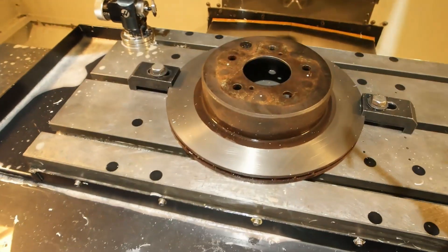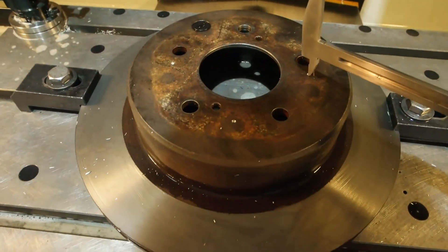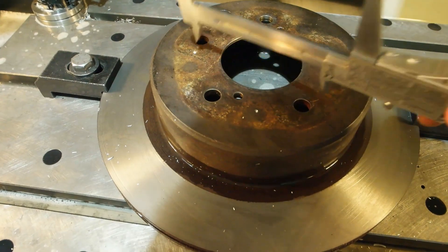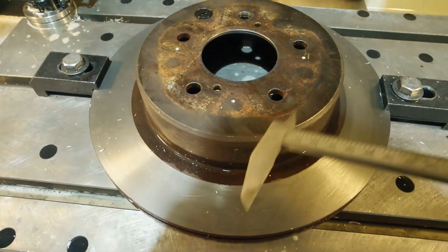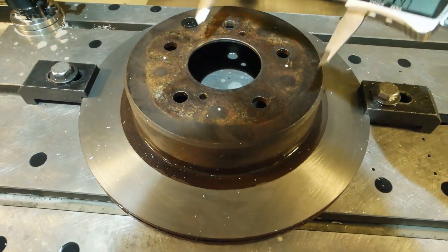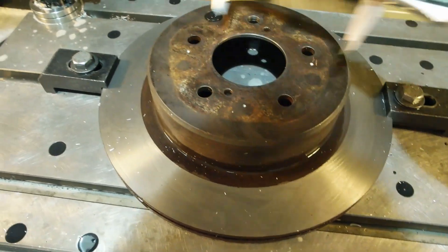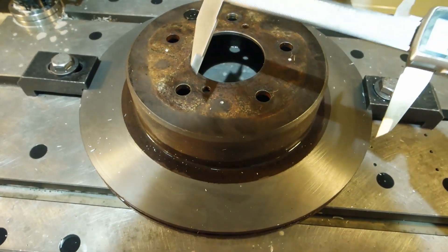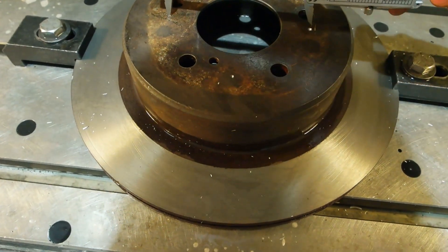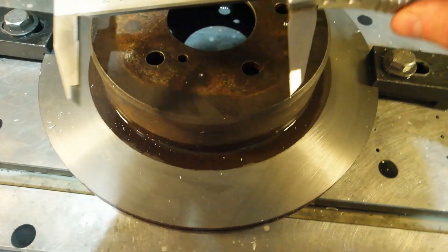Because I'm paranoid and I really don't need to use this machine very often, I like to spot drill the holes to start with before I punch them all the way through. I've also started with a rear rotor because they're not so expensive. Because there's no bolt circle pattern actually programmed into the program — it's just working off the zero — I like to measure the spots.